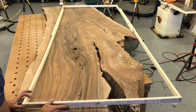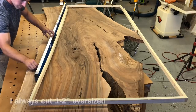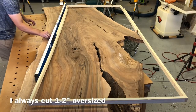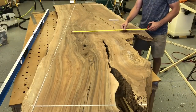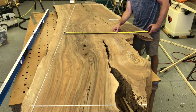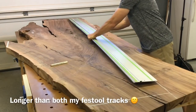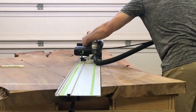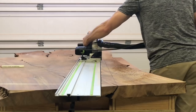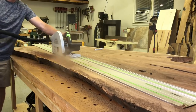The template was for an 8-foot by 42-inch table. I talked to my client and they were actually able to extend it to 9 feet in their space. We could have actually probably gone to 10 feet, but 9 feet was all their space would allow. So I extended the template to help me visualize it using the chalk line, and I always give myself a couple extra inches from the minimum dimensions — it's always easier to cut it down, you obviously can't make it bigger. I have two Festool tracks and the extenders to combine both of them to make one long track, but both those were not long enough for this cut. So I came up with a little trick that worked out pretty well — using the one track and just moving it up.